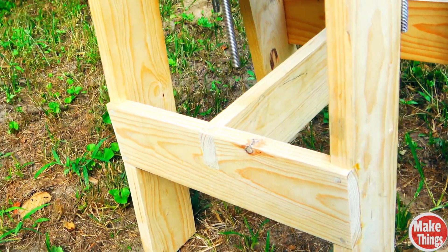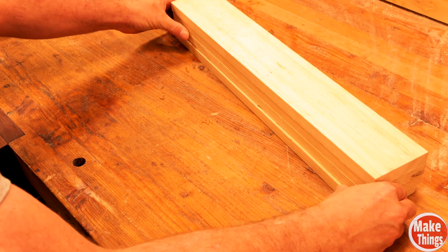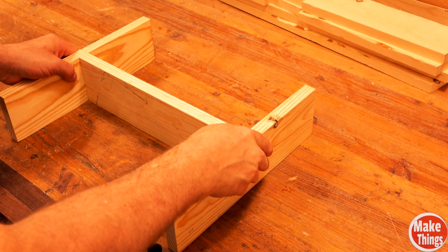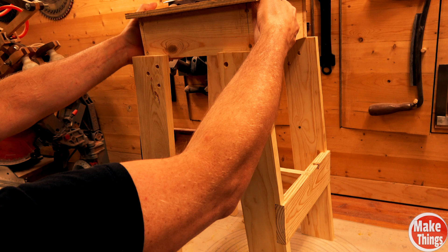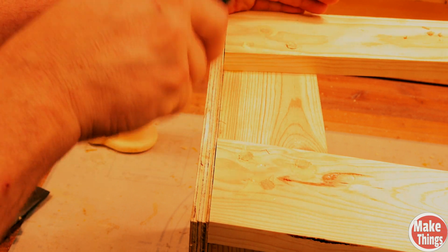Both stools were built with angled legs, which helps to prevent the stool from tipping over. The simple version's legs are easy to cut due to a full-size pattern that comes with the plans. After stacking the 1x4s, you'll simply notch out the center and the ends. To stabilize the legs below, you'll build a simple brace that slides into the center and is attached with dowels. The base is then attached to the legs. I like this simple gear stool project because there aren't any complicated joints.